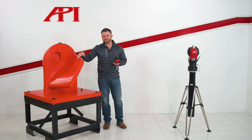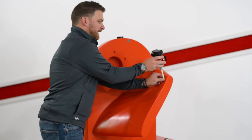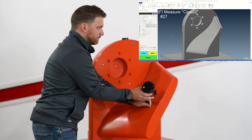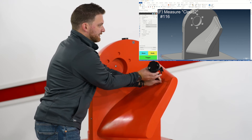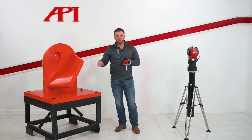In order to do a dynamic scan, we simply hold the button down as we measure. In order to stop a measurement, all you do is let go of the button. One key thing to note is that you want to let go of the button prior to removing the tip from the surface of your part, otherwise you'll get false bad data from your report.